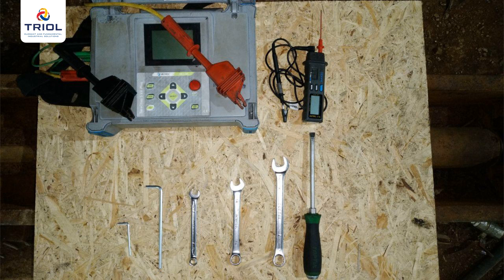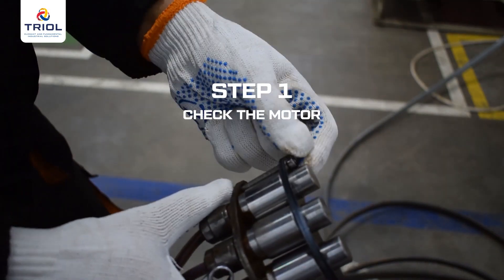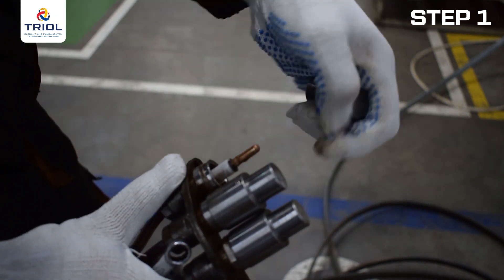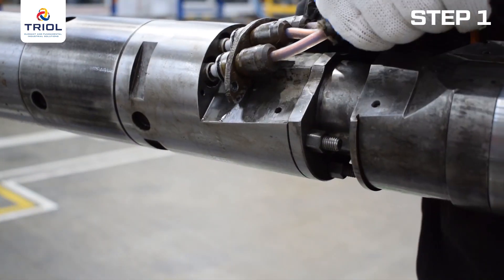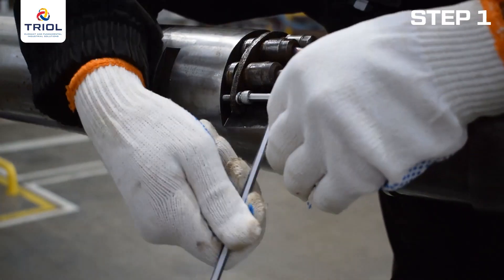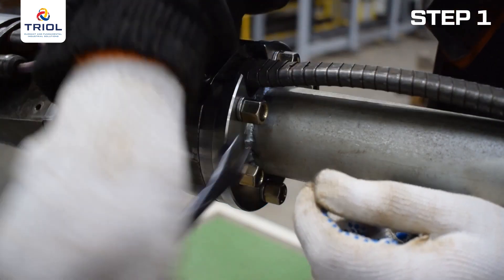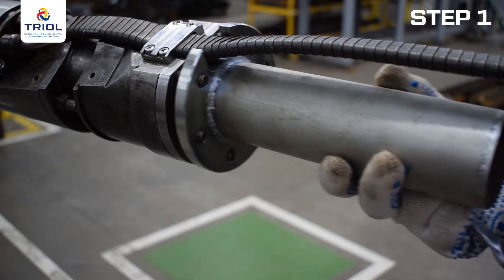Incoming control is carried out in three steps. Step 1: Check the motor. Remove the shipping covers from the cable extension using a 10 mm 13/32 hex wrench. Connect the extension cable to the motor head. Secure the extension cable with the screws to a tightening torque of 6 to 8 Nm (4 to 6 pound-foot). Use a 14 mm 9/16 wrench to unscrew the shipping cover retaining nuts and remove it from the flange to access the slider.